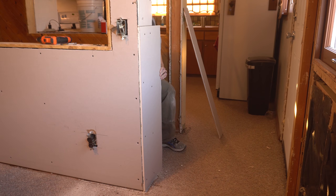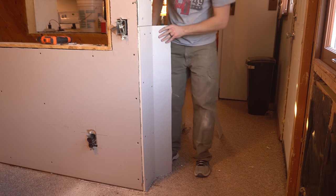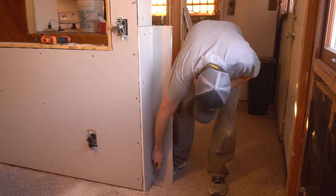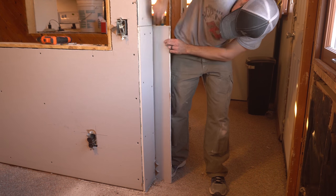Here's one good tip. When working with an outside corner, don't bother trying to cut the sheet to length beforehand. Using the stud behind the corner as a straight edge, you can score a line with a box cutter, then break the drywall at the seam, then cut through the paper on the opposite side. This leaves you with a perfect corner that didn't require any measuring.